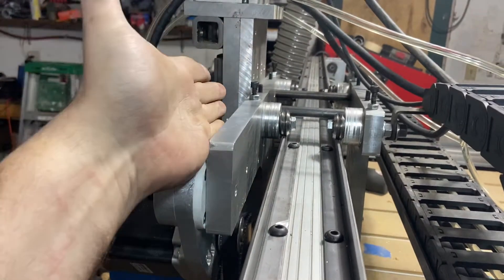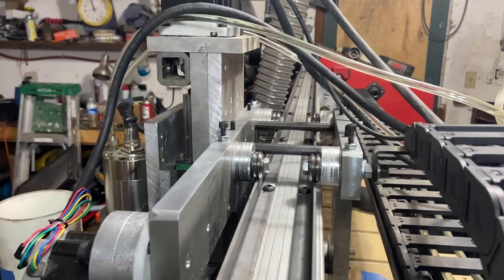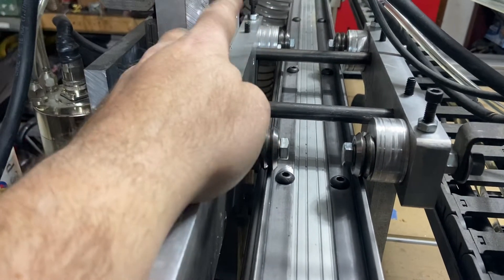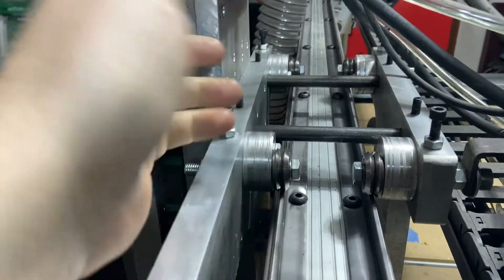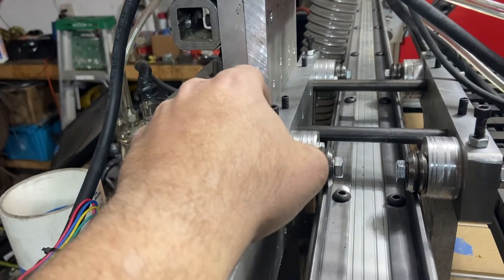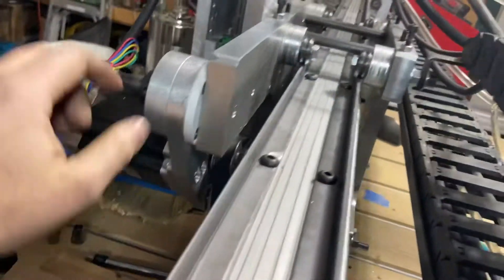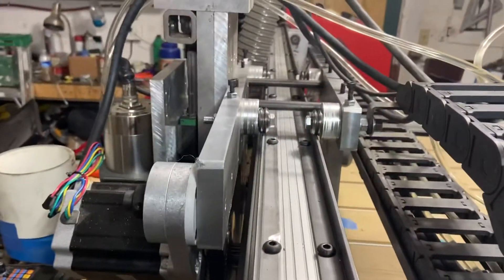I got the front plate and the rear plate parallel and dialed in - I had my Z slide all the way off so that was out of my way. Then I tied them back together by running a piece of half-inch round bar, just some mild steel round, through each plate and locking that in with some quarter-inch set screws. This is incredibly strong and sturdy - there is now zero play left or right, the bearings have good solid contact, and without the pinion engaged it's a really nice smooth roll, much better than before.